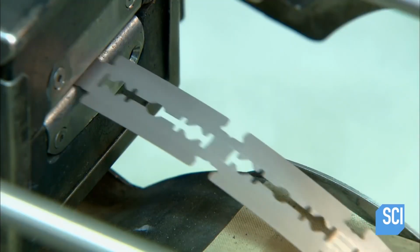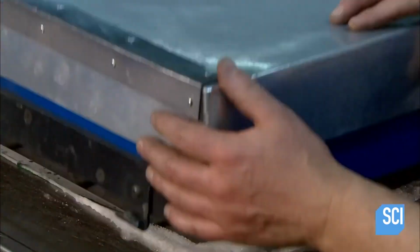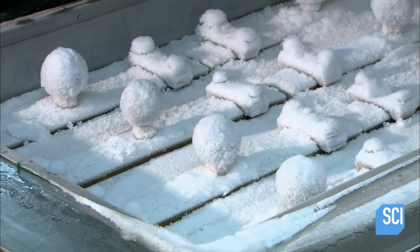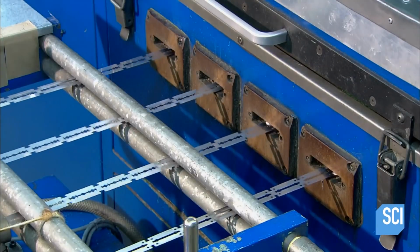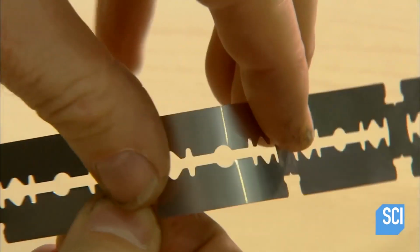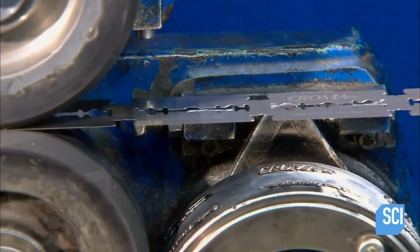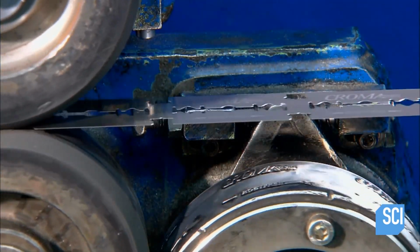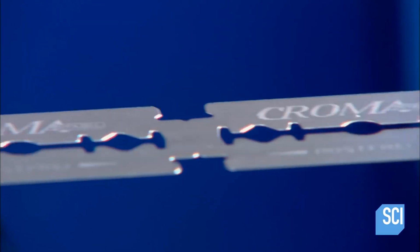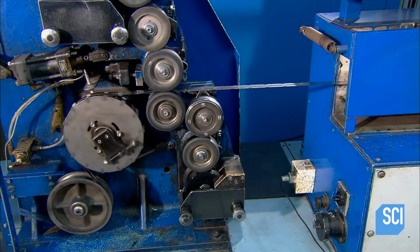They chill them for about 20 seconds in a deep cooling chamber at a temperature of -58 Fahrenheit. All this progressively restructures the molecules, hardening the metal. However, the metal becomes brittle, necessitating reheating the blanks for 20 seconds. The now hard blanks then move through a printer, which applies the razor blade brand name. Gas flames instantly dry the wet ink.